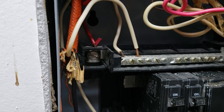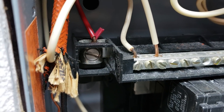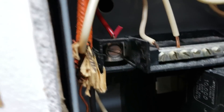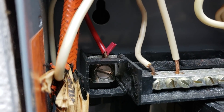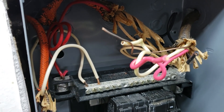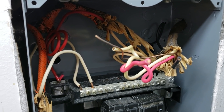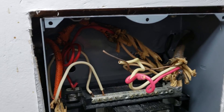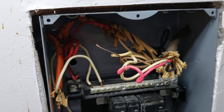So the problem is a bad connection. I don't know what this other wire that's cut off there is for - looks like there had been another one in there at some point. I think the best thing to do will probably be to shut the power off and clean that up, because it looks like there had been another wire in there. Looks like the other wires went to this other one that's going out somewhere. There must have been another downstream connection at some point connected right into the bus before the breakers, but that's dead - that's been disconnected. This old garage was on the property when I bought it in '93.